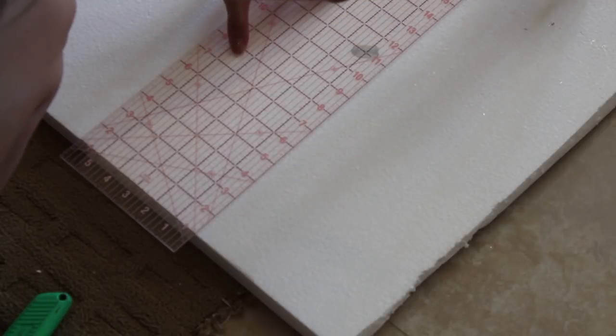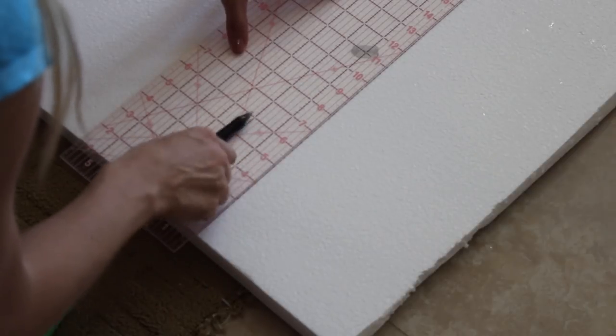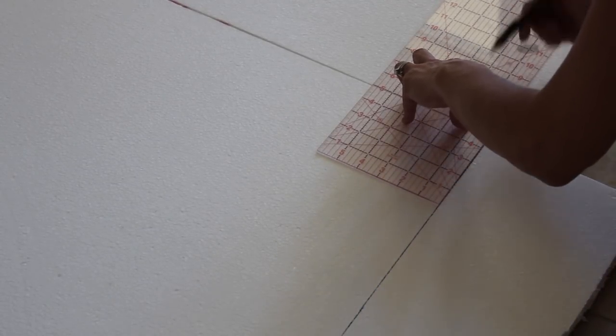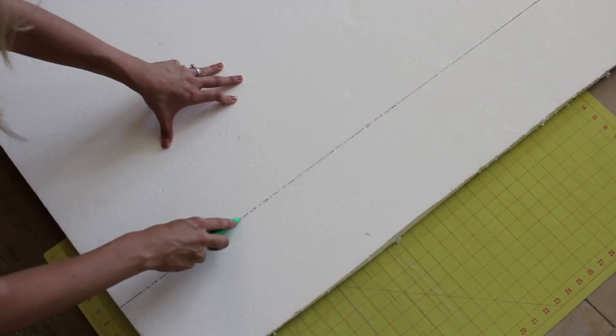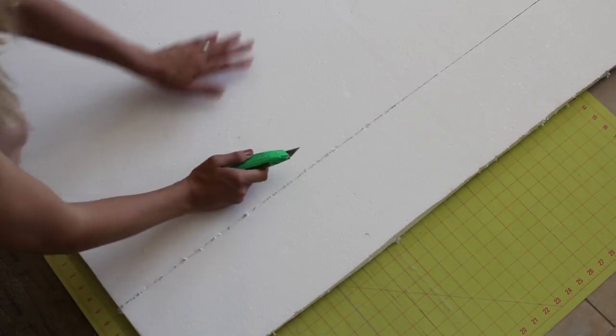This is the side that was easier for me to remove, the insulation side. I'm using a 90 degree angle and a nice long ruler to get a nice clean cut. My edges were uneven because when I went to the store, these wouldn't fit in my little Honda CRV, so my friend with her Tahoe came and rescued me. I had to have a box cutter to cut the ends off in order to bring it home. Keep that in mind if you go to the store and buy one of these big sheets. Before you cut this nice straight line, protect your floors or your surface. Once you score it pretty well, it'll just snap right in half and you'll get a nice clean edge.